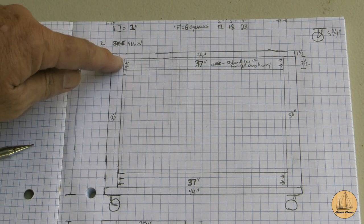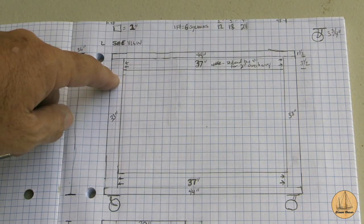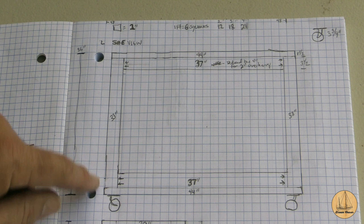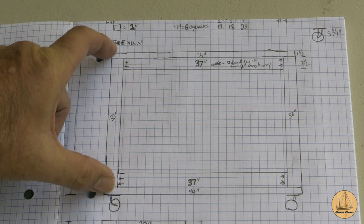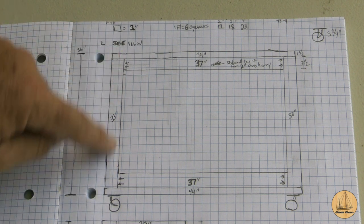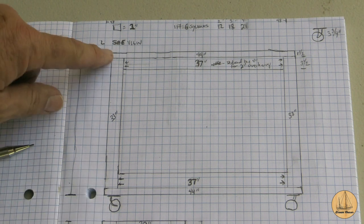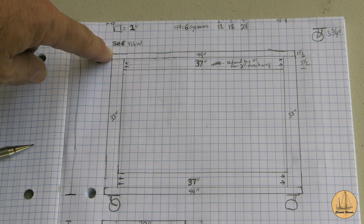44 inches are gonna sit on top of these L-shaped corner brackets, and that's gonna build the frame side of our cart itself. And again, we have 33 inches tall, plus our 2x4s on each side, right? That gives us another 3 inches. That makes 36 inches of cabinet plus a 4-inch wheel, which is what's gonna bring us up to 40 inches tall. You could be 41 to 41 and a half, depending on the thickness of the countertop you put on.